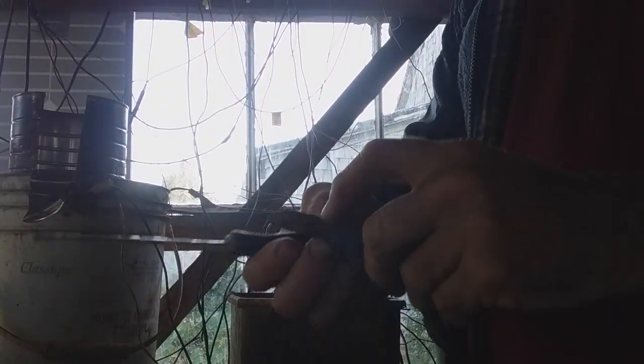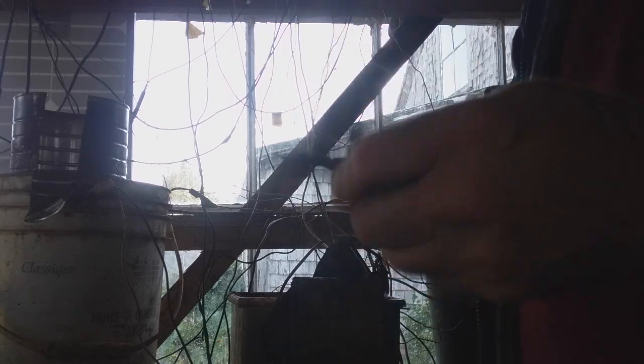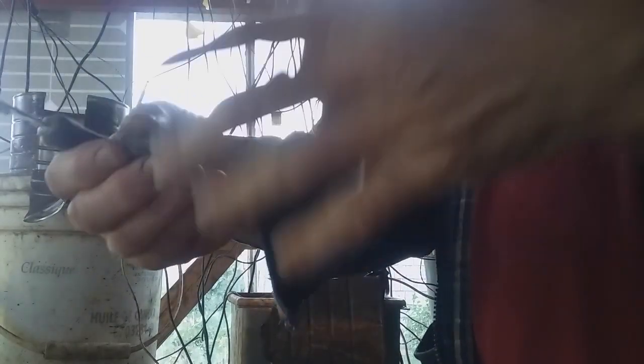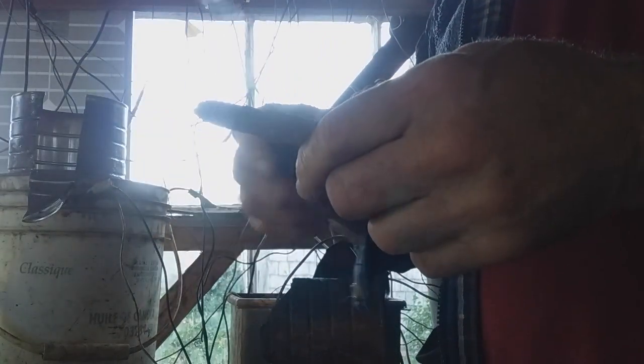Good — right here. Sometimes they're just so far gone that you cannot save them. Now, with the electrolysis the rest of the rust will lift up much easier — it will break the bond between the good iron left and the rust surface.